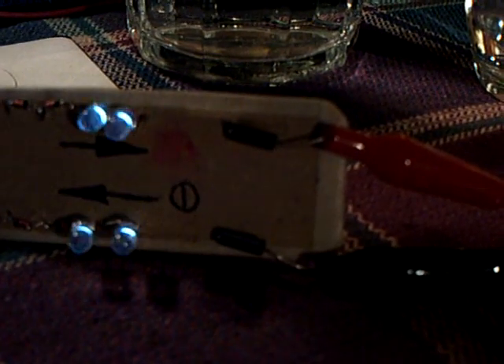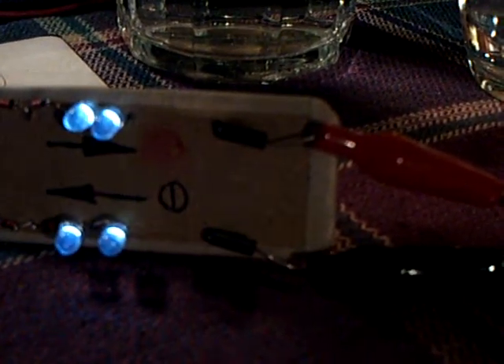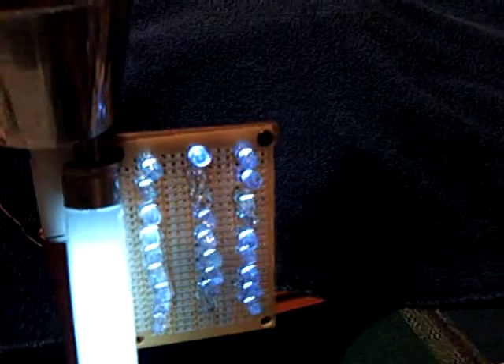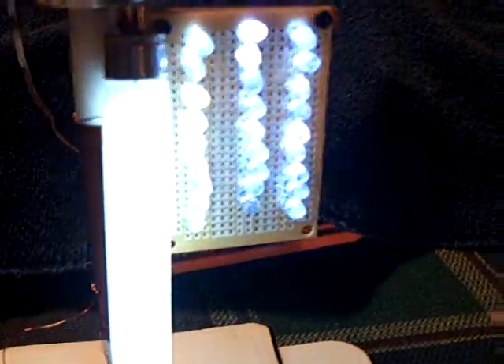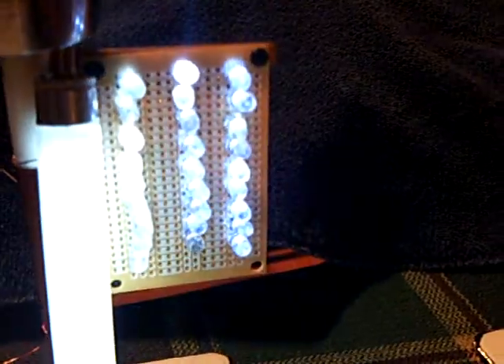Here's the LEDs on this side of the equation, and you'll watch them go in and out of brightness as I change the frequency with this tunable inductor. You can watch these go in and out too — that's a little fluorescent tube, and then 27 LEDs in series. I'm running this off a cell phone charger, mainly because that red LED acts like an amp meter, and as I vary the amp draw, that will get brighter and dimmer. You can't see it very well here in the video, but I'll show you in a minute.